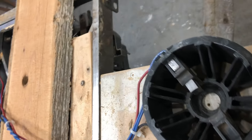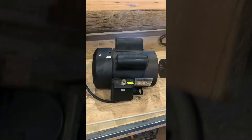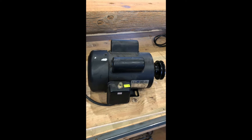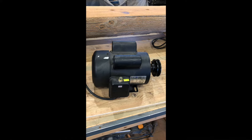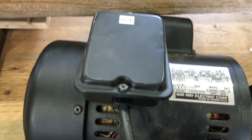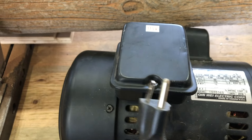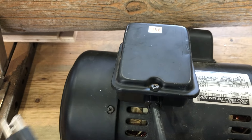So it was all that sparking that ate it away - not the bridge rectifier, not the controller. I haven't given up on the treadmill motor yet and I'm going to get some new brushes. But look at this - I got a deal on a two horsepower motor for 70 bucks. I'm going to put that on and see what it does. That's just straight AC. I got a new lead put on this motor and it runs up to a typical three-prong plug.